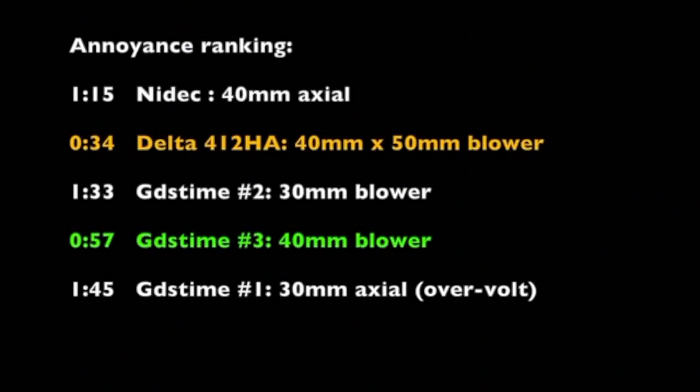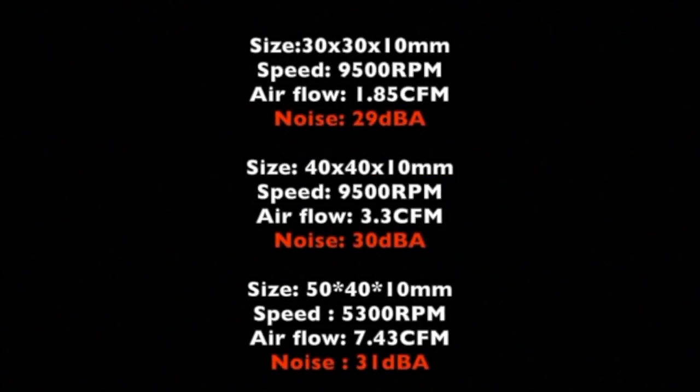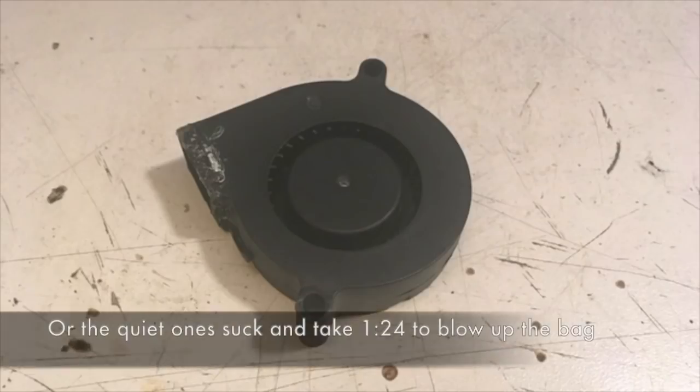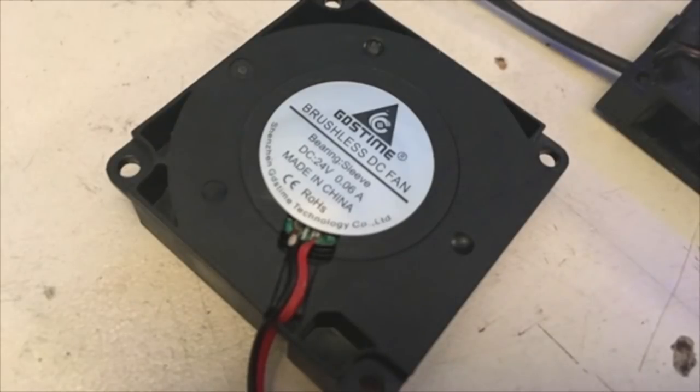So it looks like I'm going to design around a pair of 40 millimeter blowers. And then maybe I'll make provisions to make a larger one, or I'll keep an eye out for another quieter blower that's out there. I had been testing these 10 millimeter thick blower fans because I've previously been using these larger 20 millimeter thick fans, and I found them all to be pretty loud and they get a little bit rattly after a while. But I may look back into higher quality versions of these as well. For now, I'm just going to design around the 40 by 40 by 10.